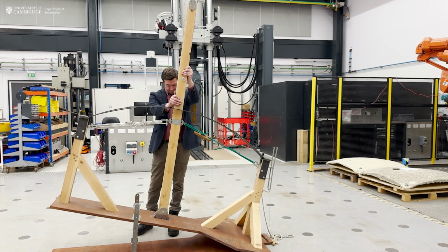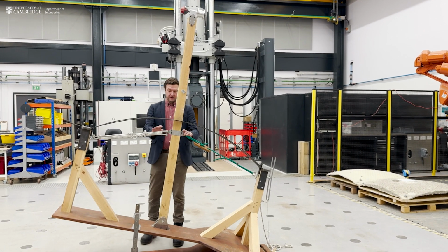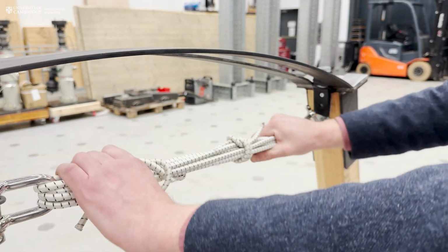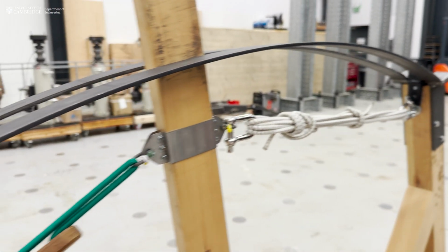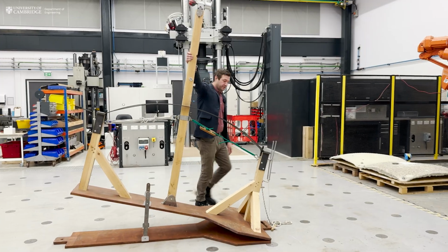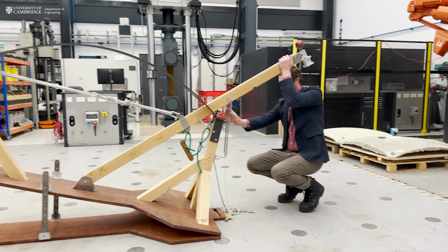central throwing arm. The throwing arm's attached with a pivot at the bottom, and it's suspended in the machine by these two pieces of elastic. This is the main power elastic. As you can see, there's substantially more here. And then the rear elastic is actually used to catch the arm and prevent it from impacting the end and therefore causing significant damage. The machine's then locked into place with a latching mechanism